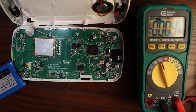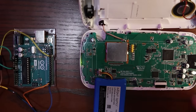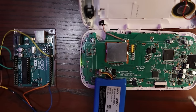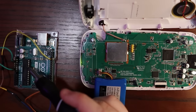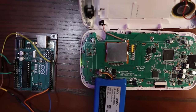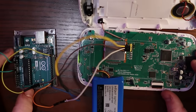Let's hook it up to a device to actually use the serial port as intended. After a questionable soldering job, I have four pin headers soldered onto what used to be the 3.3 volt transmit, receive, and ground. Normally in these videos I've seen on YouTube, people use fancier tools like a Bus Pirate. I wanted to make this video as approachable as possible for someone who may want to do this with a home router or an IoT device, so instead we're going to use an Arduino. Because an Arduino is actually two chips — an Arduino and another that acts as a serial converter between the board and the USB port — we can hang the ATmega chip in reset mode by tying the reset pin to ground. That turns the whole board into a TTL logic to USB converter that shows up as a serial device on your computer. We tie the receive pin to the transmit pin, plug the transmit pin to the receive pin, and tie together the grounds to make sure they have a common ground.